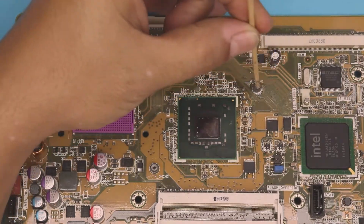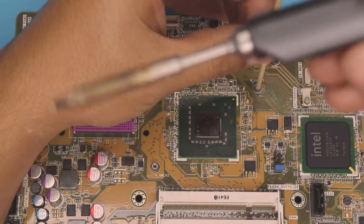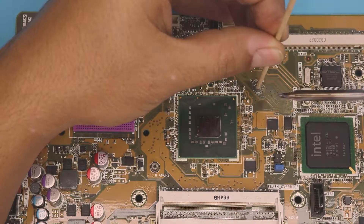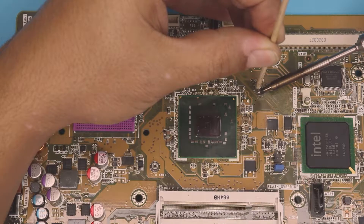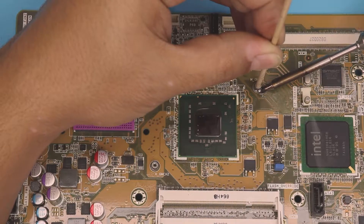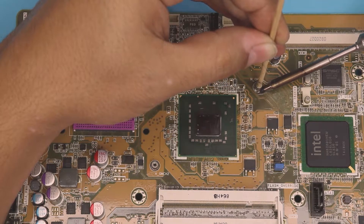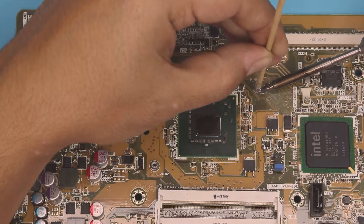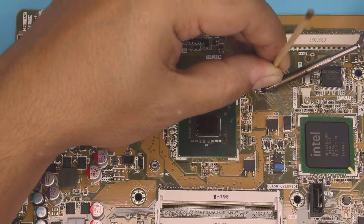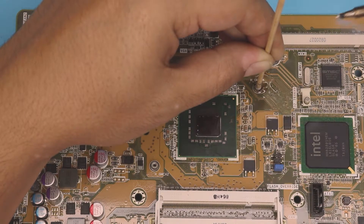Put it right in there — it's not actually in place nicely yet but I'm gonna keep it 90 degrees right on top. Grab the solder and just place it right at the bottom. The solder tip has to touch the riser to heat it up, and touch the board too. We're rotating it so the solder can go all around it. Now I left it there for 30 to 40 seconds — I'm not gonna move it at all, keeping it at 90 degrees for a few seconds, and that's it.